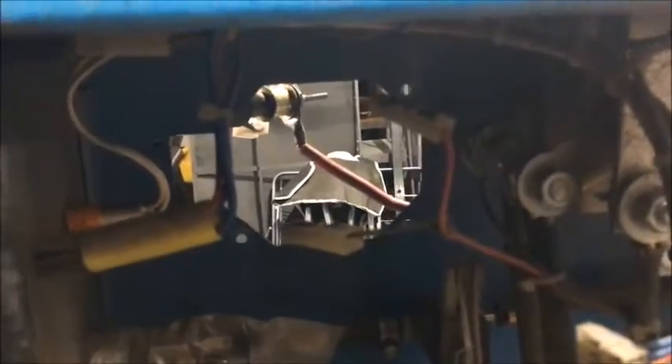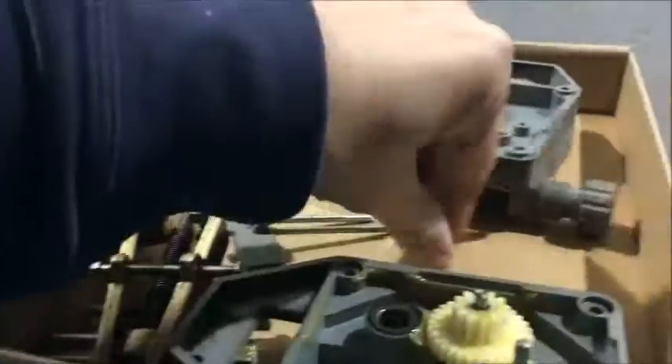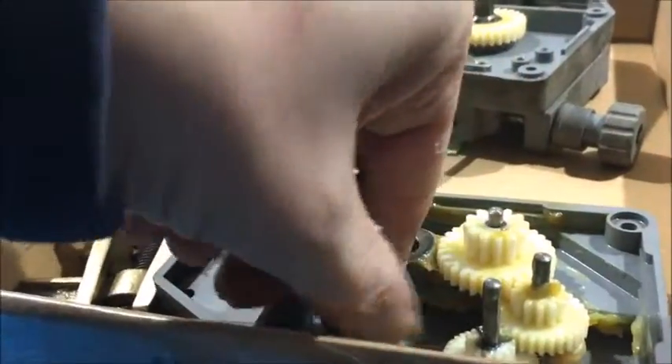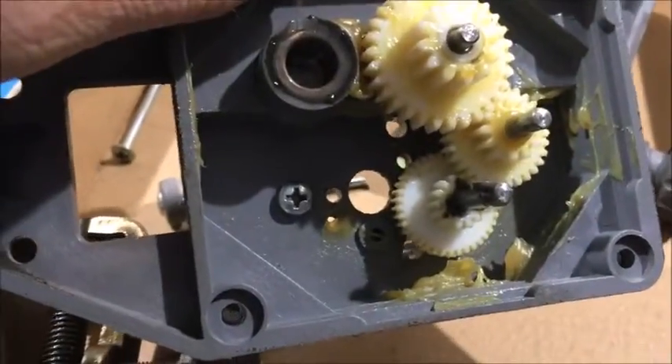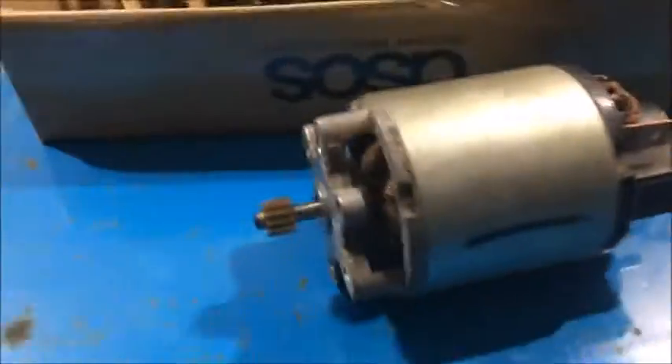Really easy to work on these. So if you need to change the wire feed motor — easy. Just undo six bolts, unbolt it, take apart your gearbox. You get these three screws that go through there — like that, so you've got three that hold it in. If you can find a motor, great. If not, just put some new brushes in and clean it up.